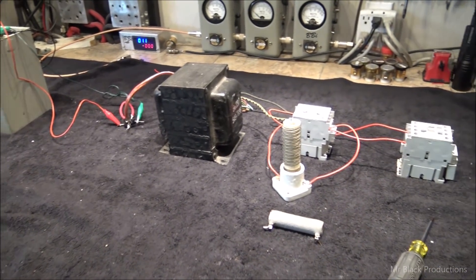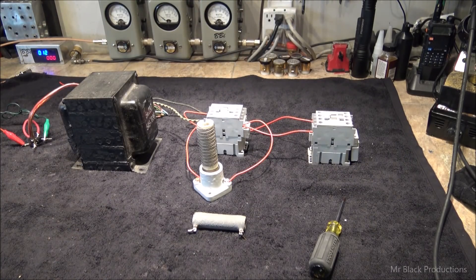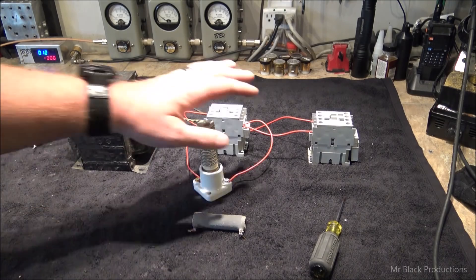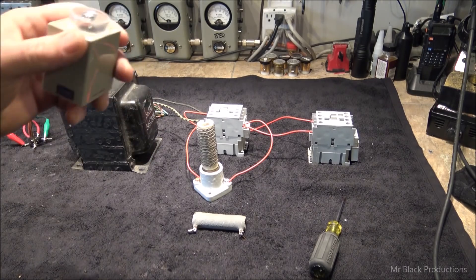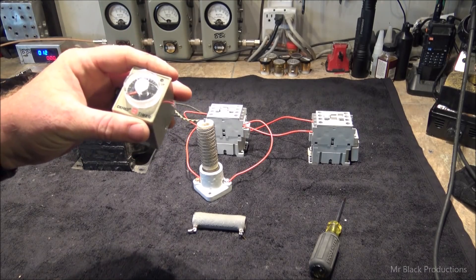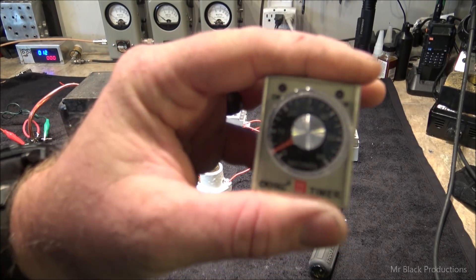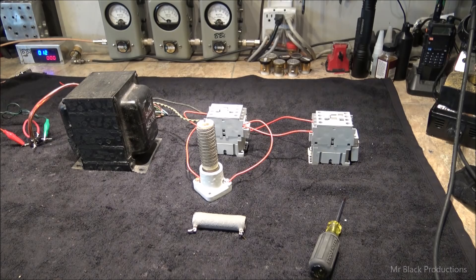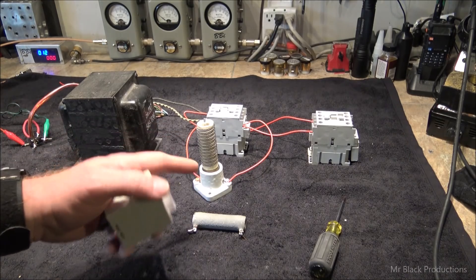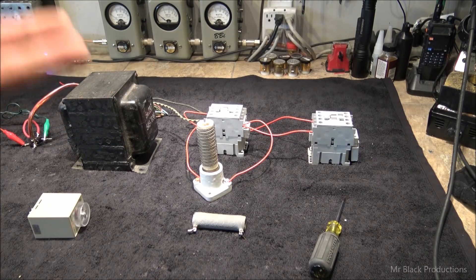And it's most minimalistic. A resistor, a contactor — they make these in 12 volt, 24 volt, 110 volt, 240 volt, and on up. So this timer is in seconds — you want to set it for about three or four seconds, because all you need to do is overcome that initial dead short and then the circuit will self-stabilize. You can go for longer — you're going to make your coil much hotter, your resistor much hotter — but you're not going to see such a dramatic improvement.